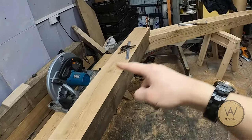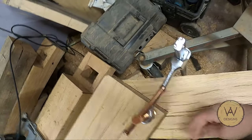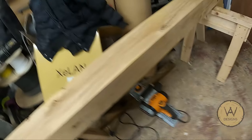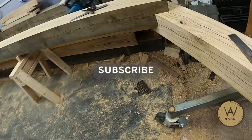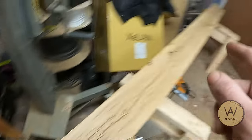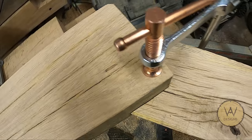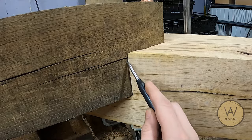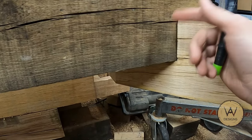I'm doing that last top beam. Instead of measuring how much I need to cut out, I've already got this piece cut — the one with the funny thing at the side. This side is a copy of that side and I know that side works because I've tried it. So I've just clamped them together and marked them out like this. I just need to get that thickness at the bottom and cut that much out on those lines, and then it's done — easy. I don't need to measure it, and it fits.